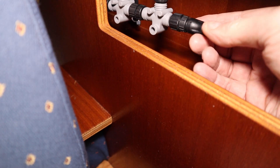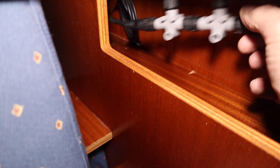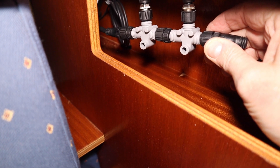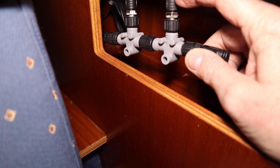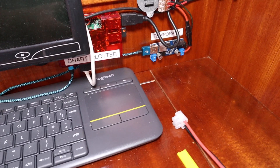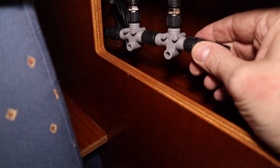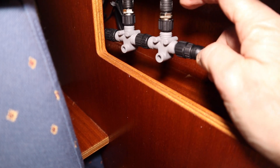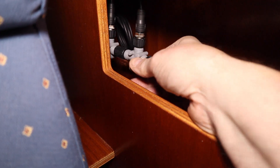This is essentially a multi-way plug for the N2K backbone. This is the end of the backbone - it's got a resistor on the end. This one goes off to the back of the boat. This one is for the N2K converter which feeds the little chart plotter at the nav station. This one is from the AIS. Very neat, very easy - and the power for the AIS comes out of this too. I'll screw that into place but it's really secure there anyway behind a cabinet no one looks at.